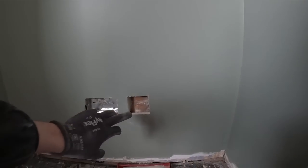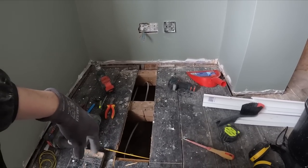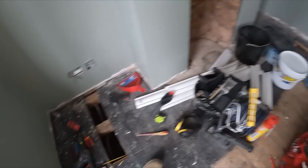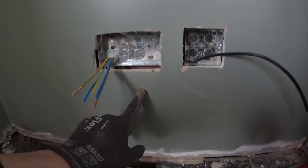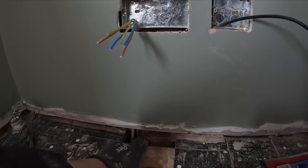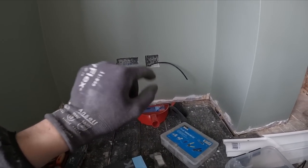I've got a metal box here, got the 20mm open grommets. I tried a rod and it goes straight down — I'll lift this board up, cut a corner out, and throw the cable down. The rod's across now so I'm pulling in the data cable. I'll fish it up and fix the box. The box is secure in the wall, grommet in, cable through, running like that and then straight down to the data cab under the stairs. I'm bringing it down the opposite side of the board, away from the power — data cables mess with the internet if run alongside power.